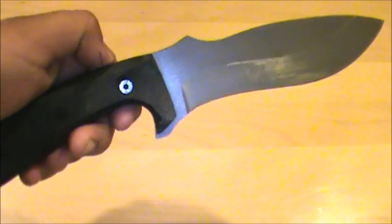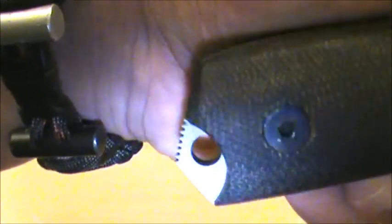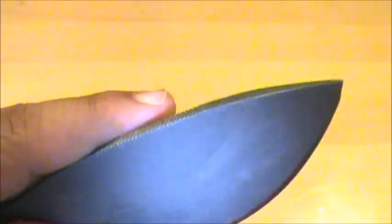This was the first knife I ever used with S35VN steel. It has a good heat treat on it to about 60. You can see the recurve I designed — it was designed for fighting and utility, so just call it a fighter utility blade. It does have my prototype marking on here: P1, which means prototype one. It has Chicago-style screws on it. It has one of the nicest little recurves I've seen — it just looks stylish. You can see jimping right here so you can choke up on it, and it has a choil so you can jump up on that. It has a guard so you can't over-penetrate if you're pushing it into something. There's jimping for skinning and jimping in the reverse grip as well. Very comfortable knife.